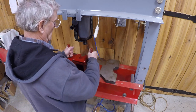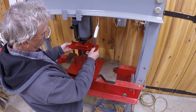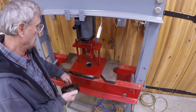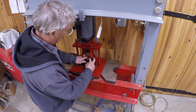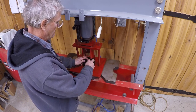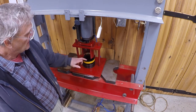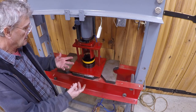The way this works on my press: the unit goes in there and you basically put this on there, adjust so it's centered over the hole. You then take your die ring, put it in there. The collets are made in two halves, which makes it easier to get in there. Place them in evenly, put this in, and then start pressing. This part contacts the ring, which presses and makes the die compress on the tapered walls.